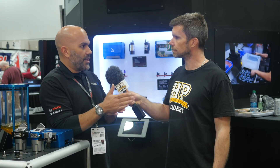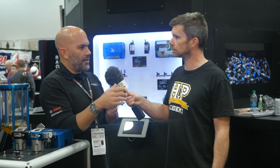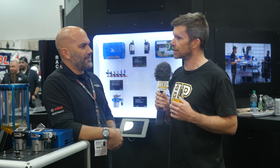The engine doesn't even have to be running to check it. The fuel pump needs to be on at full flow, which happens at the lowest pressure, so you want to check it at idle — that's the best case. If the indicator moves over, you change the element. It goes from zero to five PSI so you can even see it getting there gradually. You end up changing it before you're swapping out your engine because the filter was clogged — it's a cheap way of protecting a potentially very expensive engine.